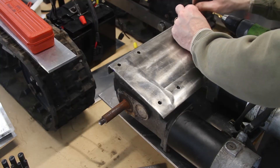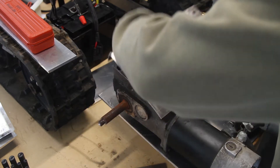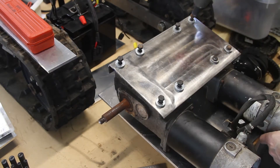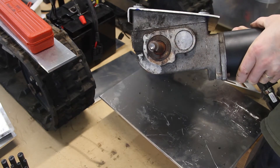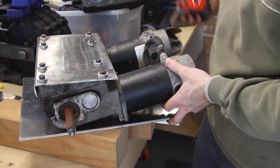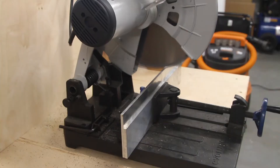I've got a bit that's 21/64ths — that's 1/64th larger than 5/16 — so I'm just going to go through these quickly. That is good and solid. I'm really happy with that. Is this parallel with this? That's five inches — it actually is parallel.